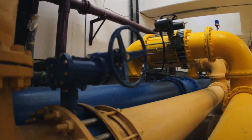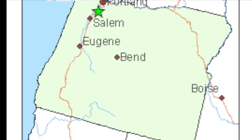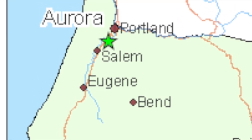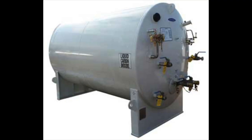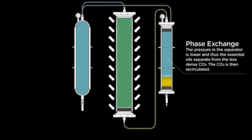The recaptured CO2 will be sent through a filter and then combined with a fresh stream being pumped from an industrial site located 22 miles away in Portland, Oregon, before entering an accumulator. The accumulator tank will hold the CO2 at a liquid state by maintaining a pressure of 100 bars and a temperature of 5 degrees Celsius before being pumped into the extractor once more.